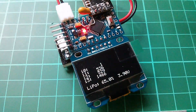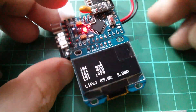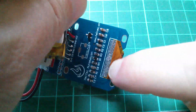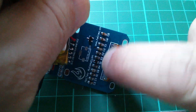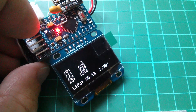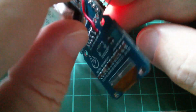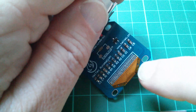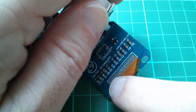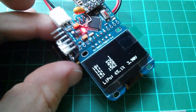In part one of this video I was having a lot of trouble with this display — it kept cutting out. In the end I discovered the cause: touching this connector on the back made it cut out. I initially thought it was induced signals, but it was much simpler — I just had to touch all of these flexible PCB connections with a soldering iron, and now it's completely rock solid.